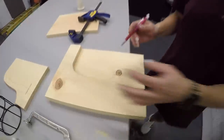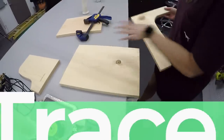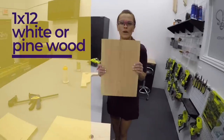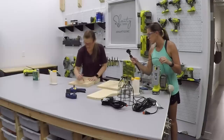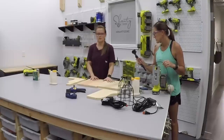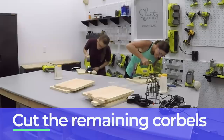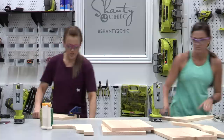I'm just taking my pencil along the beautiful corbel that you've already cut and tracing our next one. I'm going to go ahead and draw all these out so that we can whip through these. These are one by twelve whitewood or pine boards. We just use one by twelve as our base, so we're building two corbels with one 1x12, because you can cut all the other little scraps from the one by twelve. Two is better than one, so we are going to team up and get the rest of these five cut out. We've got this corbel cut and now we're using it as our template to cut the other five.